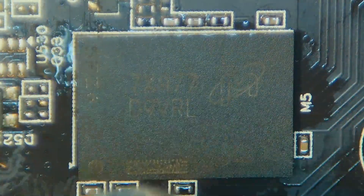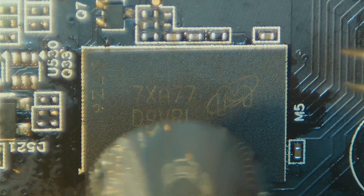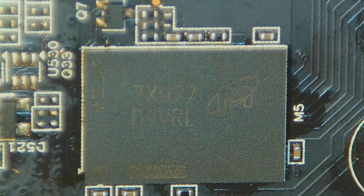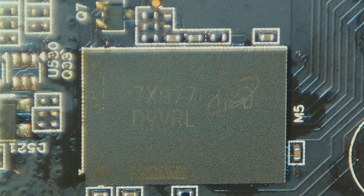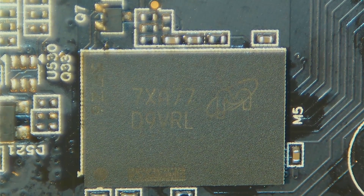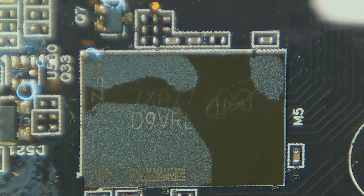Next up is reflowing the chip onto the board. I've put a thin coat of flux onto the board and aligned the chip. I'm using a higher airspeed to heat up both the chip and the board. I'm bumping the chip to check if the solder is making a good connection. I know that the chip is soldered properly if the chip moves and then moves back to its position. The chip is now soldered and I can clean the board and assemble the card.